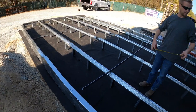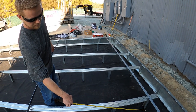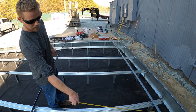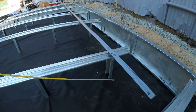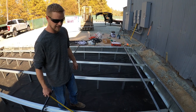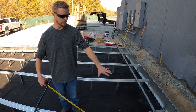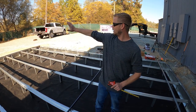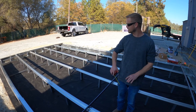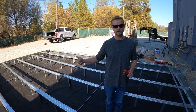We still have a few more steps. Tomorrow, we're going to grab some wall base for steel studs that we're going to throw up underneath all of these, because I don't like how they just sit on their own. So we're going to run those all the way down across all of them. We're also going to put plastic down everywhere. We just didn't want to put it in yet and have it get ripped up. So tomorrow we're going to go grab those pieces in the morning, move all these away again in order, roll out the plastic, put the runners in for the base plate, and then start assembling everything back in order. And at that point, I think we can start zipping everything in.